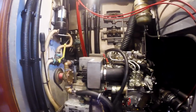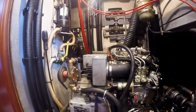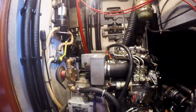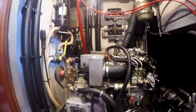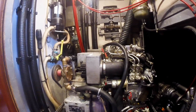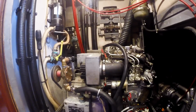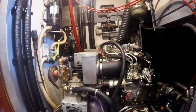It's not wired properly, we found out at the panel, because of the way the lights light up, there's actually two of these. There's a temperature sensor on the exhaust manifold, and there's another one on the head. And we think it's the one on the head that's tripping. But I'm in the process of trying to debug the problem.